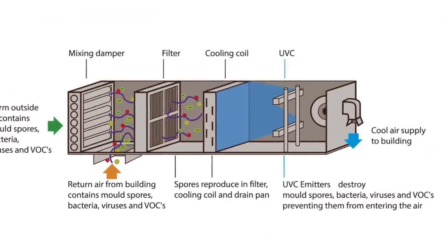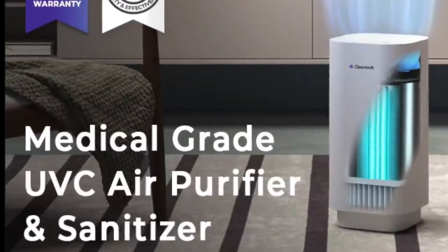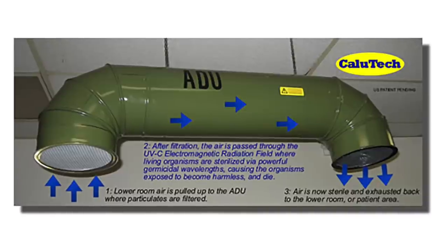One very safe way of implementing UV is to put the lights in the ventilation system, but this costs quite a bit to engineer and retrofit, and some of the places we are talking about barely have windows let alone a ventilation system. Generally, UV lights are not very effective in standalone air filters because the air moves through too quickly so it's not exposed to the light long enough to kill viruses. Sometimes you see schemes that put UV lights in a box with a fan at one end, hoping to both shield the dangerous light and irradiate the air coming through — but this generally does not work very well, and takes up quite a bit of space.